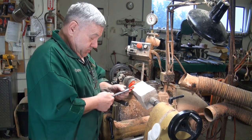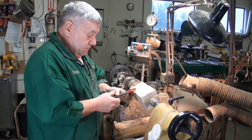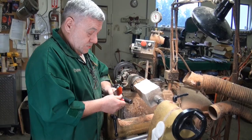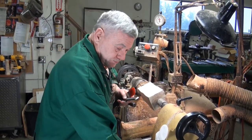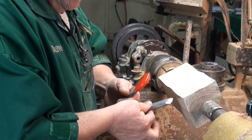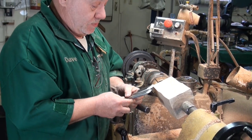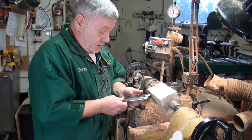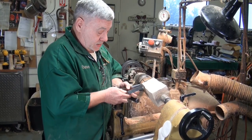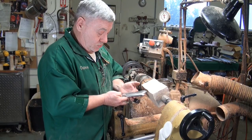We're back on. I'm going to cover a little bit of roughing out on spindle work. The three tools I have for that are my two skews — a large one and a small one. The way they come shipped to you, I have a parabolic curve on the end of them. When we go to the grinder, I'll show you how I sharpen these. Be careful — they are very sharp. There's about 70 degrees here, something like that. It's radiused on this side for rolling beads.